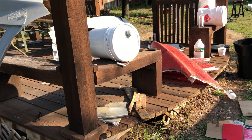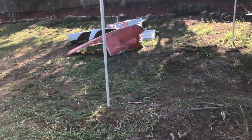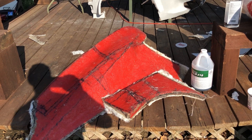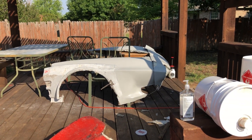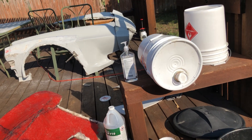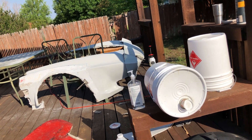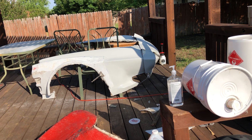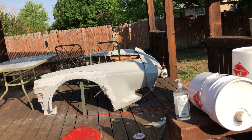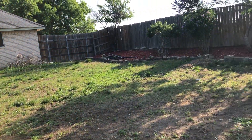I've got to have this car done no matter what. Here are my molds — since I spent the time to make better molds and use the improved mold release process, the fenders that came out are not perfect but they're close enough. Once everything is done a mold has to be made off of the finished car, so it'll all be straightened out, painted, and looking nice. After the Street Rod Nationals I may scan it and CNC carve the molds — but that's a future thing.